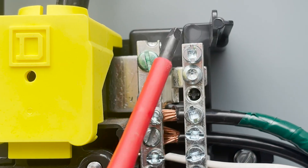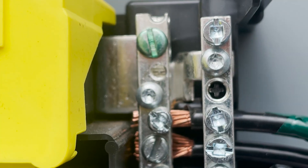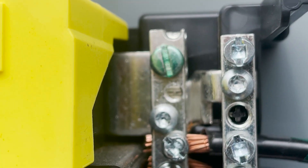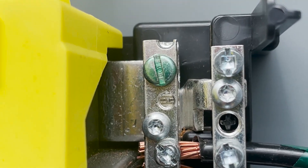You could use a strap; some panels you buy will come with a green screw — like Square D panels — where it comes with the enclosure and you screw it in place. That bonds the metal can to the ground bus, to the neutral bus, everything together. Or if you don't have any of those things, you need to take a conductor and actually make a conductor-dependent bond, creating a bonding jumper.